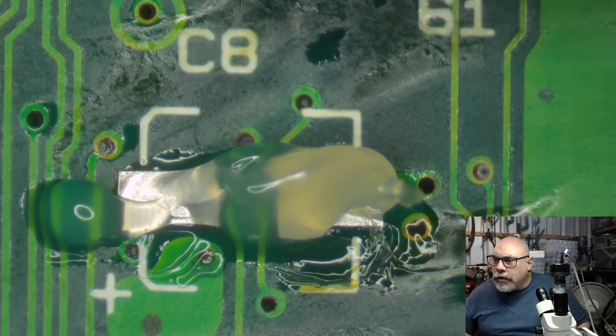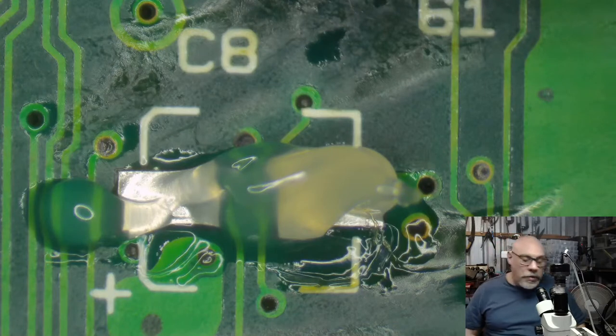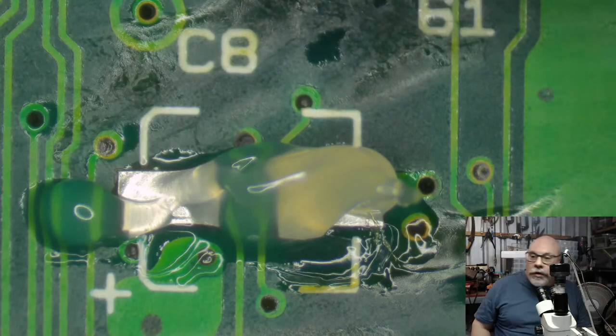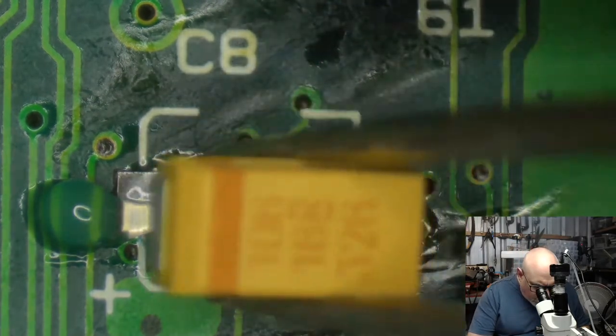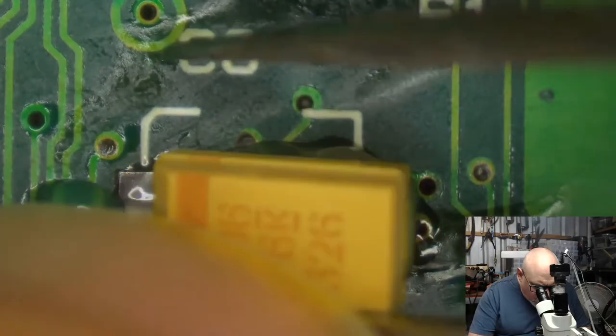If I find the right SE30 at the right price, yeah, the Classic 2 seems like a bit of a dud in comparison to the SE30, although if I saw a Classic 2 at a garage sale for $50, I'd still grab it. The main problem with the Classic 2 is you're going to have to recap the logic board and the analog board. They don't have that PDS slot that the SE30 had, which is always annoying. Which is, of course, that other thing with Ethernet network and stuff like that.